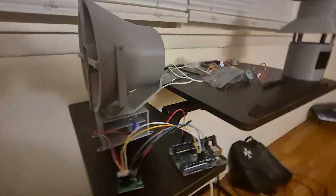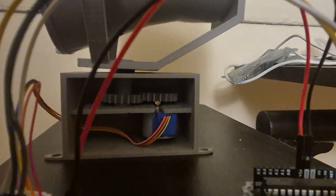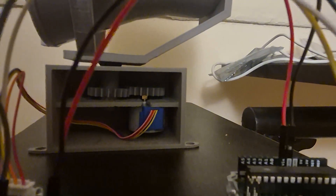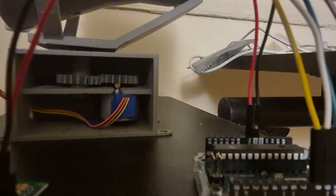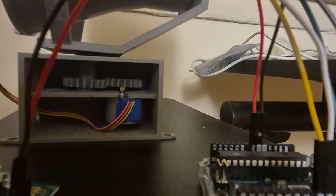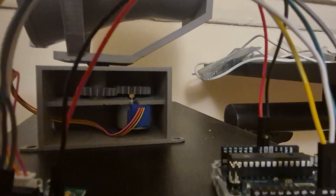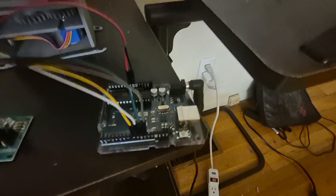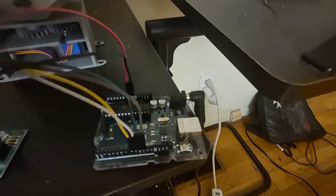If my camera will cooperate, I'm going to try to get good views of what I got going on down here. The rotator box down here is really just a gear and motor system with an axle that attaches to the actual projector itself. The motor is just an off-the-shelf standard 12 volt stepper motor that you can get from any electronic supply store, Radio Shack, et cetera. This is just a normal Arduino Uno R3, and that was my board of choice.